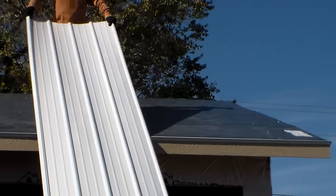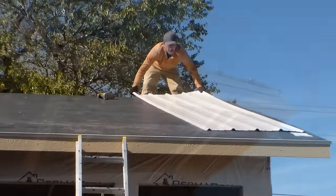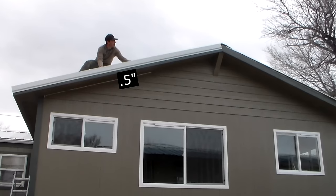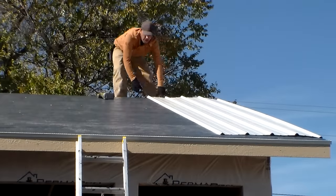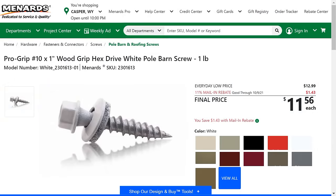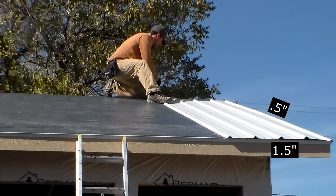The majority of these panels are already the correct length, so I just need to start placing a couple panels in position. What I'm going for here is an overhang on the front edge of approximately one and a half inches from the fascia. And on the gable side, I'm looking for about half of an inch overhang. But this half inch measurement only applies if gable trim is going to be used. If there's no gable trim, then I'd recommend at least a one inch overhang. And the top of the panel should be located within a few inches or less from the peak, and this measurement can vary depending on how wide your ridge cap material is. To secure the panels, I'm using some painted hex drive screws that include a gasket for a watertight seal. The screws just need to be long enough to make it through the metal and sheathing. So right here, I'm trying to square up the panel as close as I can to the roof edges with my desired overhang.